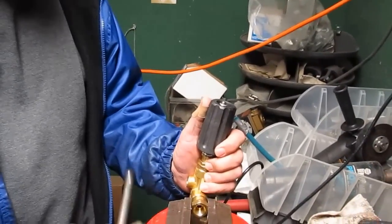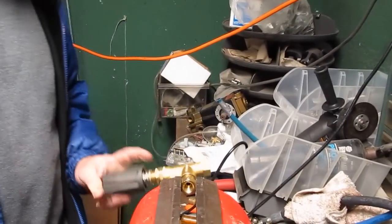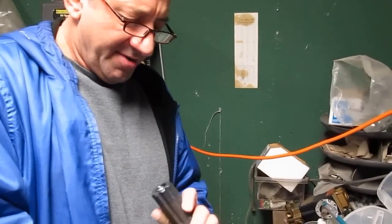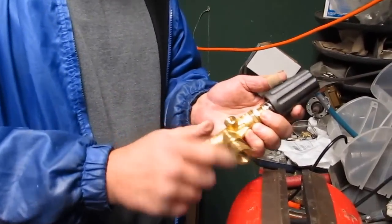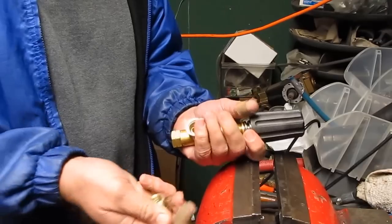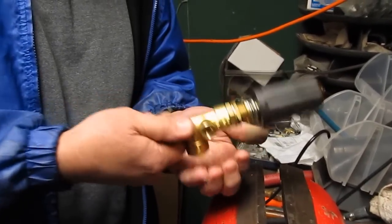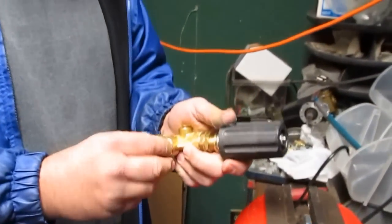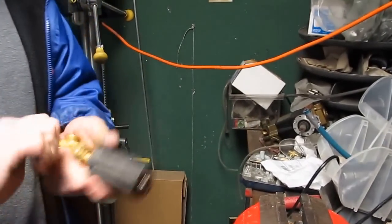and just have an in and a bypass. You can do that with a vise by turning it, or you can put a wrench on this and hold it. You get this off — it's the out port that unscrews; neither of these other two ports do. And inside there you're going to see there's a spring and a piston. That makes the check valve a check valve. You take that out, and you've now defeated the check valve function.